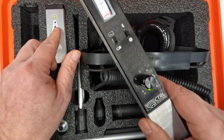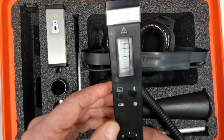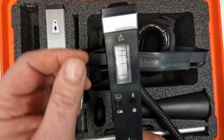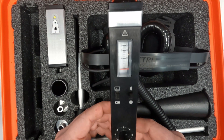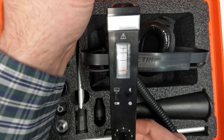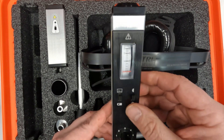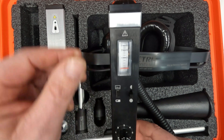You can test the connection and sensitivity of the UL101 by rubbing your fingers in front of the microphone. You will clearly hear the presence of ultrasound without any ambient audible sounds, which is important in a noisy manufacturing environment. The analog meter indicates the relative intensity of ultrasound. The switch on the right is a gain control switch — half moon is half sensitivity, and full moon or full gain is full sensitivity.